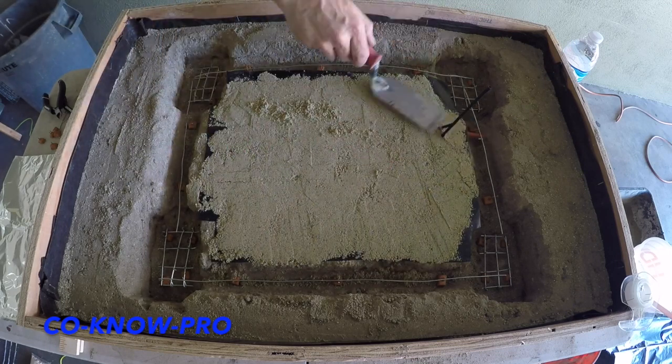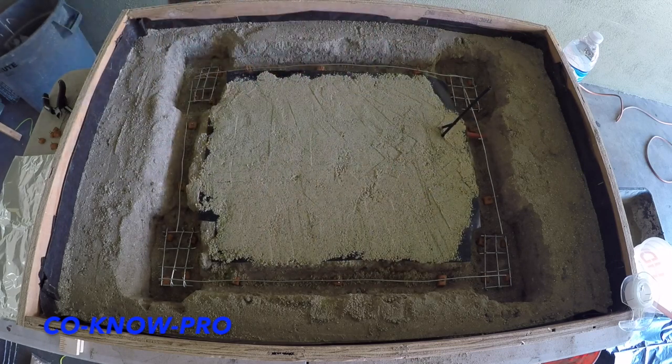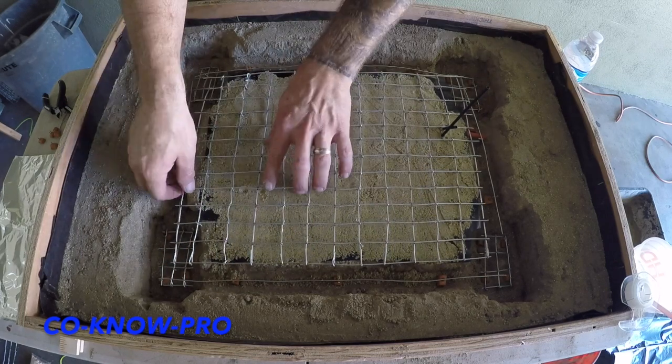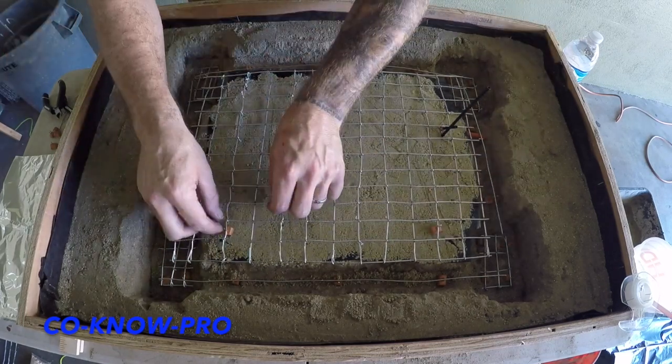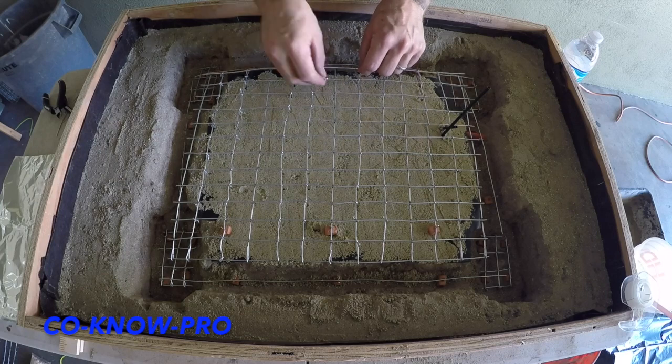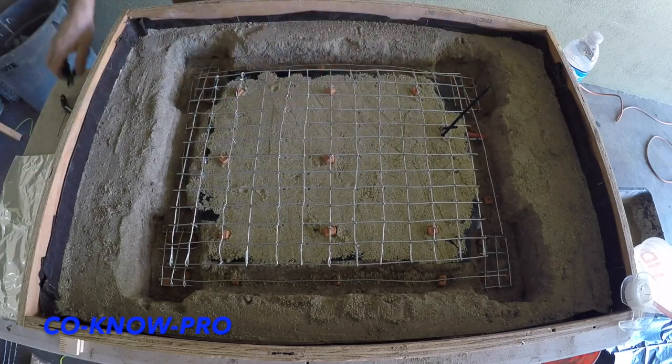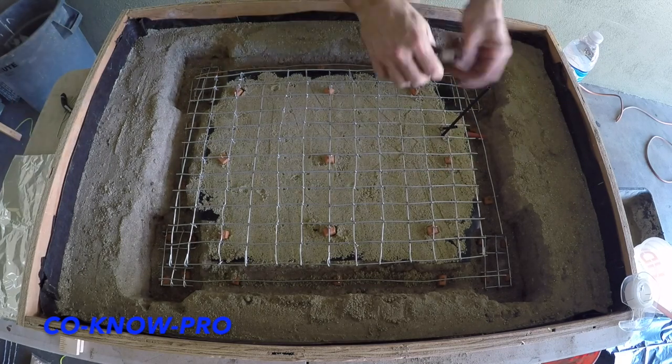In this case, I couldn't find rebar at this scale, so I used some 16-gauge wire as my reinforcement steel — basically as my rebar. We made our grid, basically a typical 16 by 16-inch grid, number four rebar, staggered and everything. So we got that all locked in.